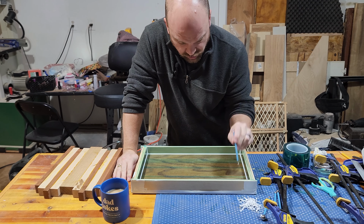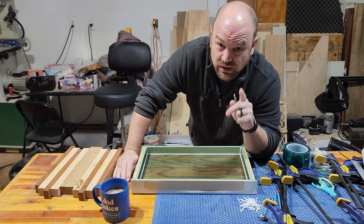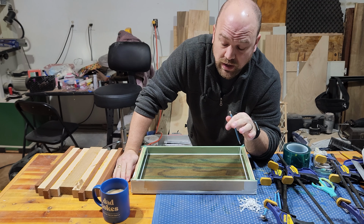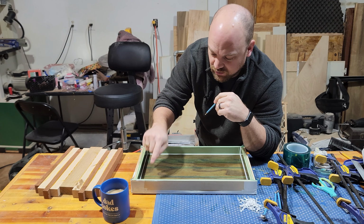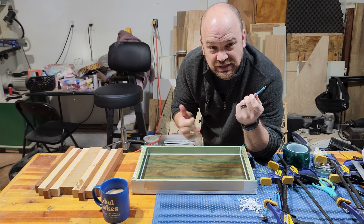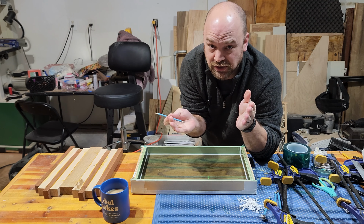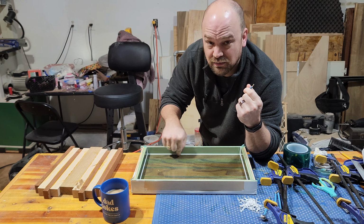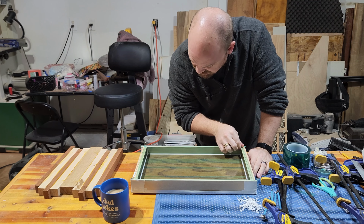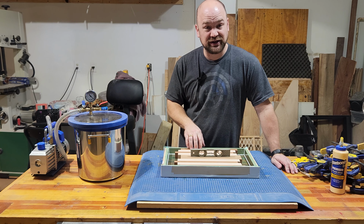If you are doing this, hey, a couple things to note. One, make sure you're using 100% silicone caulking, which I did, worked really well. But two, I'm used to laying down a real thin bead of caulking when I do stuff like this. It actually was easier in the spots where I laid down a thicker bead of caulking, because what this does is it just creates a separation between the two. So I'm left with a really fine line, and if I had a thick piece of leftover, it pulled off real easy. I'm glad that I did this. This was a good little experimentation. 10 out of 10.